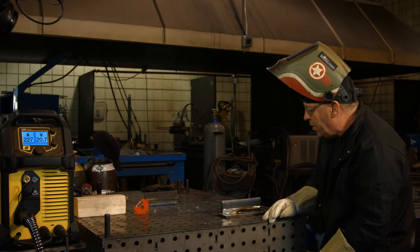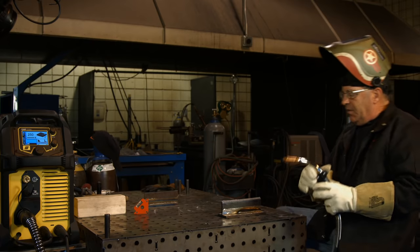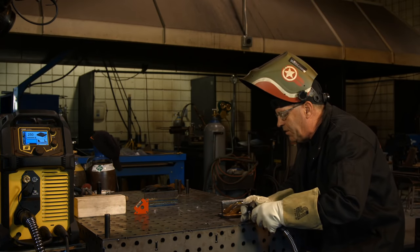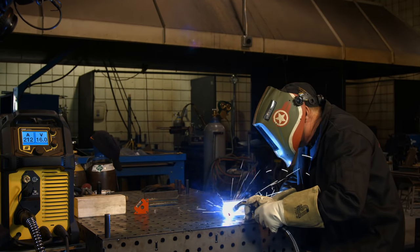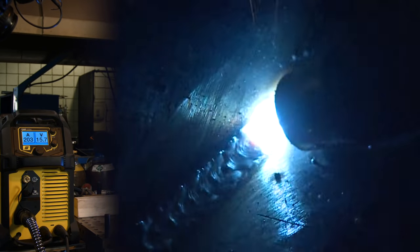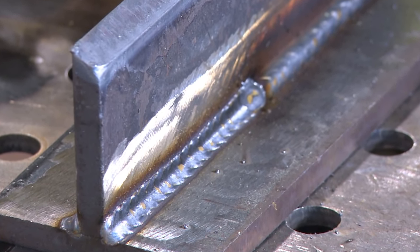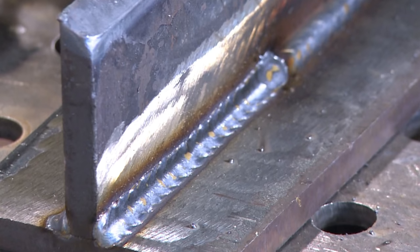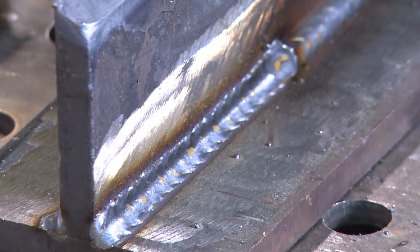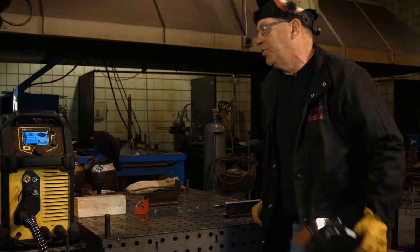Got a heavy pop going on. I'm going to make a slight adjustment more to the concave side and weld back toward myself this time. The bead came out convex, good shape — it sounded okay, but we have 95/5 gas on and this is nowhere near spray. The voltage read 16.2 and the amperage said 221. I need to change this machine — I want to spray.